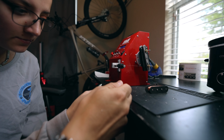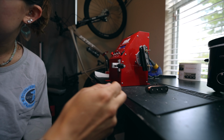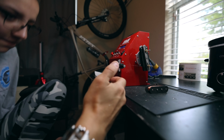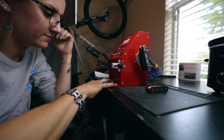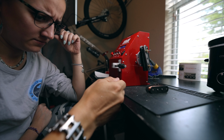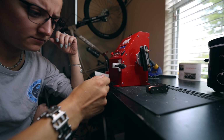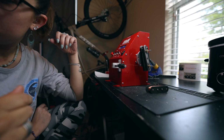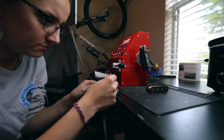But everybody has a tendency, as time goes, to lean back a little. So stay in that one spot and lock it in. That's why I use the table to lock the corner in. When we do these classes, I actually tape the winder to the table so it stays in one spot. So that distance right there is super sweet. And if you lean back, then you'll probably break the wire because you'll lose control of the tension. Go ahead and get comfortable again and try it again.